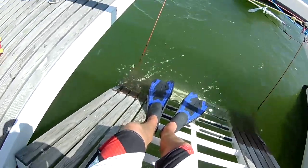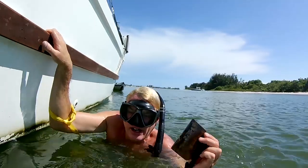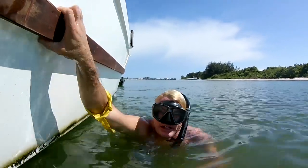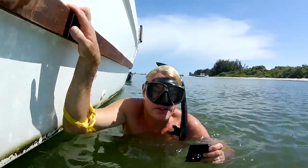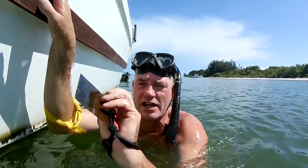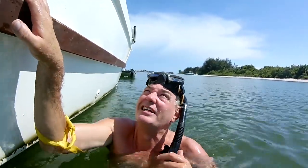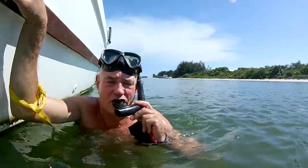We're going to anchor and scrape the barnacles off the bottom — hopefully they come off easy. It's been sitting here in Sarasota Bay for nearly 5 weeks and we haven't de-slimed it, which we should have done every 2 weeks. And now we're about to pay the price. Sarasota is possibly the marine growth capital of the world — the harbour is constantly fed with nutrient-rich runoff, warm temperatures and limited flushing from the tides. But even with barnacle growth on it, it comes off clean with a nice sharp metal scraper — slow, gentle strokes right back to the Coppercoat. Pretty bad growth, worst I've ever seen.